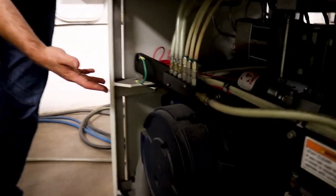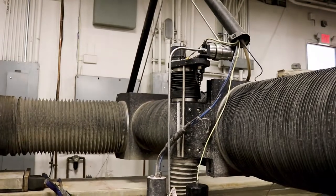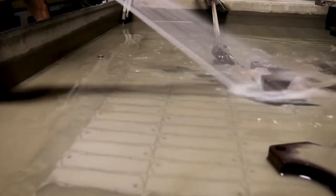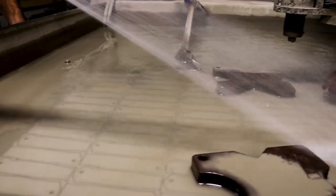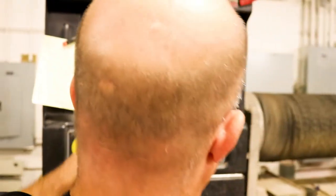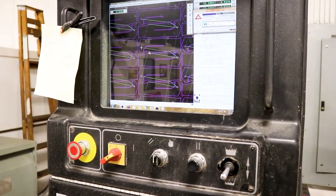Then we run it through a pump that's 55,000 to 60,000 psi. That goes through a series of high-pressure stainless steel tubes out to a CNC controlled head that moves around on the table in an X and Y axis. We'll lay our material out on the table — whether we're cutting ferrous metal for blades, titanium for handles, or sheet metal thin pieces of titanium for clips. We'll call up our programs that we've drawn and engineered, nested and connected together with traversing motions of the head, and we turn it on.